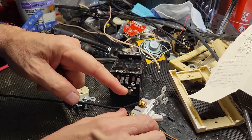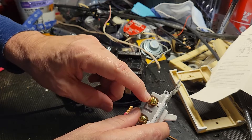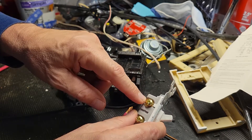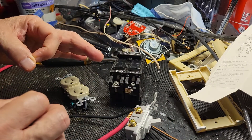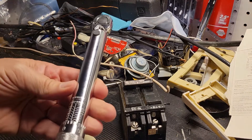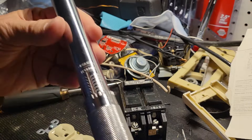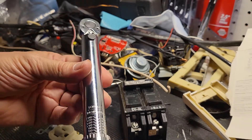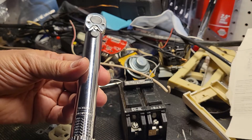If you over-tighten, you could damage the internals of the device. You could pinch the wire so hard that it might fail in the future. So the correct torque is very important. To achieve a specified torque level, you need a torque wrench of some sort. Most wrenches like this are for foot pounds — they're basically automotive type applications. For electronics, you want inch pounds.